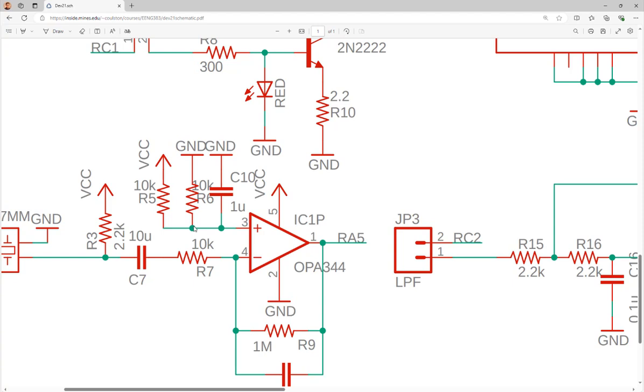Why? Resistors in parallel with the same resistance. Oh, they are not in parallel, it's in series. Right? It's power supply and running current to the ground. It's forming one loop. So it's in series resistor. It's a voltage divider. So here's 50% of the voltage of VCC. So why do you need 50% of the voltage here?